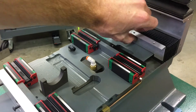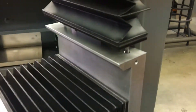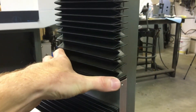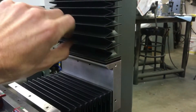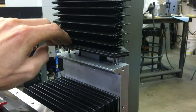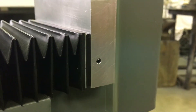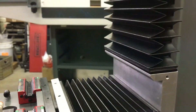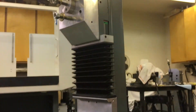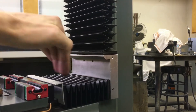Here are the bellows — custom made in China. Maybe I'll make a separate video about it. These bellows are designed to be quick-release for servicing, or if you want to look at the screw. You can see the bellows have pins in them — these pins drop down and there are set screws that capture them. It's like that on both ends, and this end is removable as well. You pull those out and you can drop it down, because with these they're trapped on there. So if you wanted to do some poking around you'd slide it from one side, take that side off, and slide it, or vice versa.